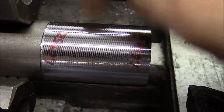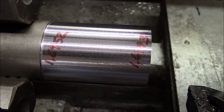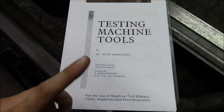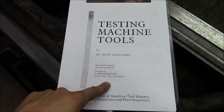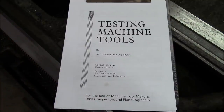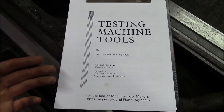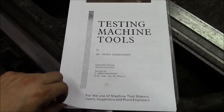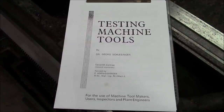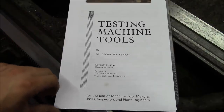This machine has an adjustable headstock so I could probably take care of the taper pretty easily — I know the machine's level, so the headstock is probably out of alignment. If you want to do a very scientific thorough evaluation of the geometry of a machine tool, this is the book you need: Testing Machine Tools by Georg Schlesinger. He was a German industry expert around the turn of the century who compiled basically a Bible of specs from different manufacturers for machine tools, with information about how to do testing, what tools you need, and a guide for each type of machine — grinder, shaper, lathe, mill.